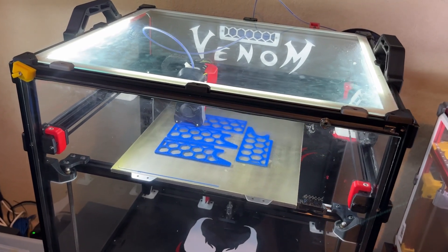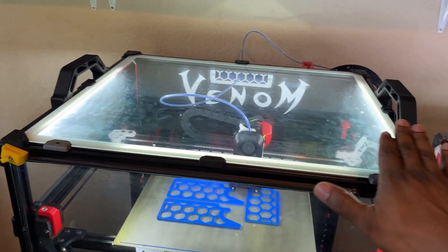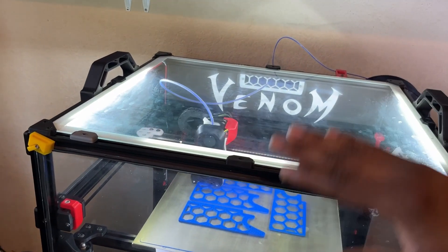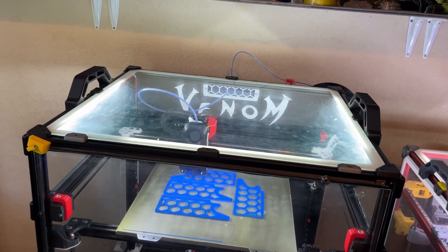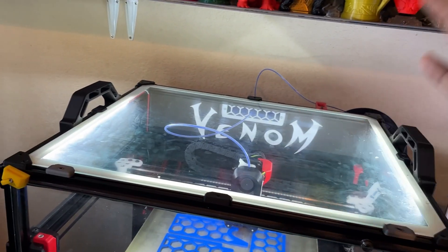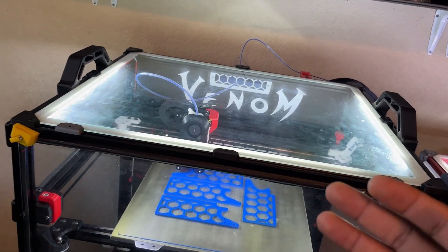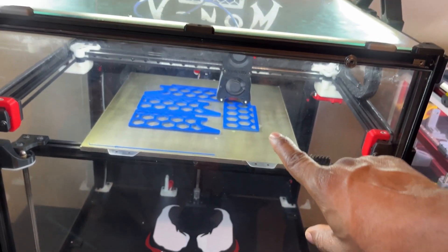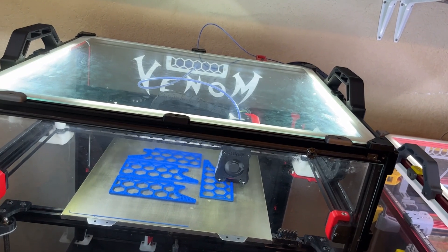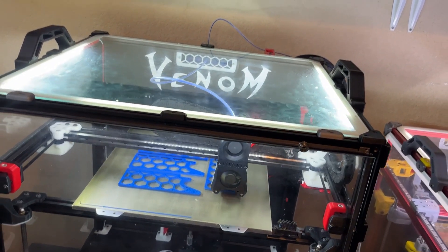The problem is the chamber got efficiently hot — to the point where I'm having nothing but extruder jams. Before there were some gaps, enough to equalize the heat being built up in the top chamber. But because I redid the setup to minimize the ABS smell and seal as best as possible, the chamber got even hotter. Hot enough where the fan in the front blowing on the hot end was just pushing 65-degree air. This thing hits 65 degrees, pushing that on the hot end which is already at 240–250, and it just caused jams.